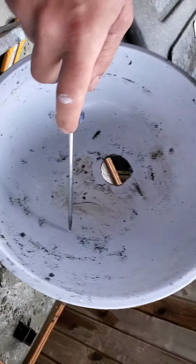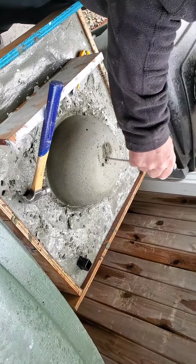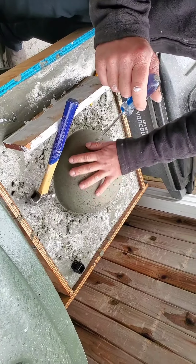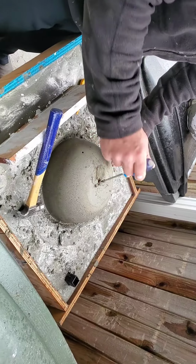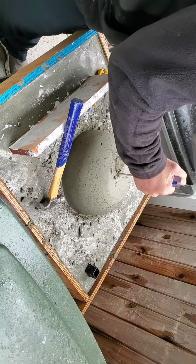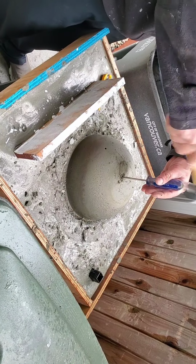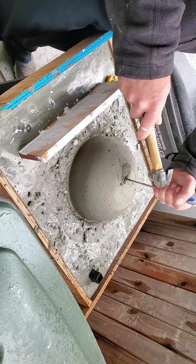You can see where the oil helped. It's condensating the heat. You want to do this quickly in the morning. Like, you don't want to let it dry too hard. This concrete has not sealed. It's not finished. So this is what I want to do with trimmings, because once it gets hard as a rock, I won't be able to do any of this stuff. My little pipe I put in here so I can run gas lines or air or whatever.